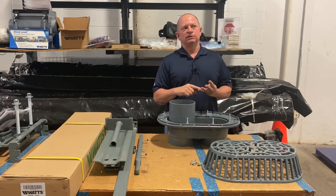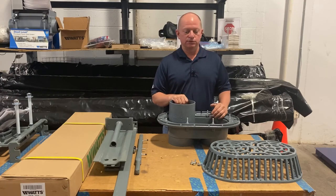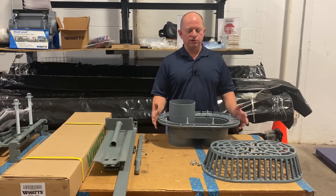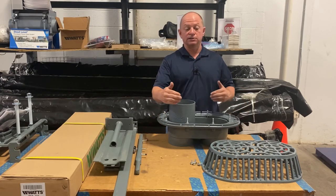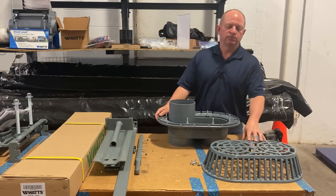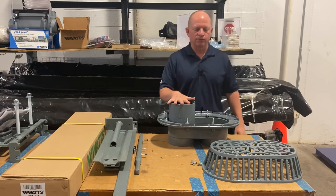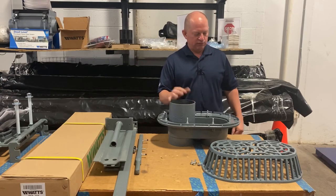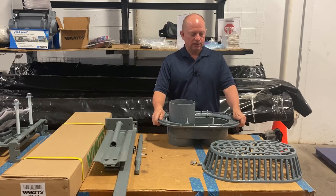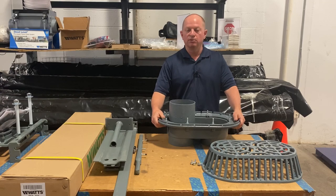These are available in 3, 4, 5, and 6 inch, and they have an RD800 in 8 and 10 inch versions — that's a big one. The same options are available: a sump receiver pan, a pan to jack the whole thing up for thick insulation, and it comes standard with a ductile dome. They also have aluminum versions and a cut type where the overflow is cut. You just set this in front of a building owner, architect, or engineer and it sells itself. We sell quite a few — this is almost standard in Prince William County schools now, and we put a lot on fire departments.